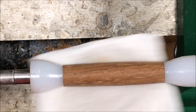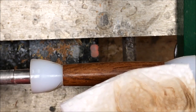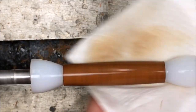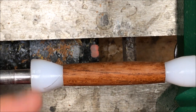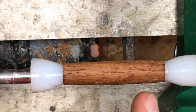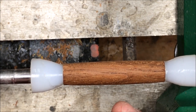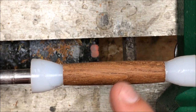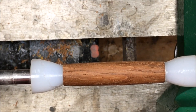I sanded the blank through 400 grit. Now I'm going to use a little denatured alcohol — I always like to rub with the grain first to clean out any debris. Look at that, it's all coming out from within the grain. Then I'll turn the lathe on and run the denatured alcohol soaked paper towel back and forth over the blank. I've already got my non-stick bushings on. Don't touch the blank once you've put the bushings on and run the denatured alcohol — your hands have oil, you could be sweating, you could have dust on your hands, and anything will be transferred to the blank and encased in your CA glue finish.